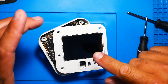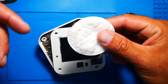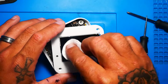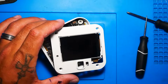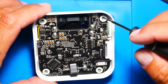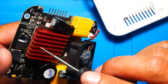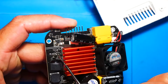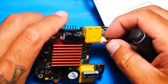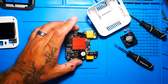Alright pilots, real quick before we continue on, I want to tell you: if you accidentally touch your screen, they have these little cotton deals that are for your face to clean off your makeup when you're done flying. You can use these — they're fantastic. You wrap your finger in it, give it a little rub. It might leave a little bit of fuzz, but you give it a blow and you're all gravy. We've got our screen off and we're going to set that to the side. We're going to have to start testing components and see what we can find. There's our fan and we've got a nice heat sink. I'm thinking I'm seeing some action here — something looks like it might be burnt right here, maybe a regulator or something. I'm going to pull this fan out of the way and get my multimeter to do some testing.